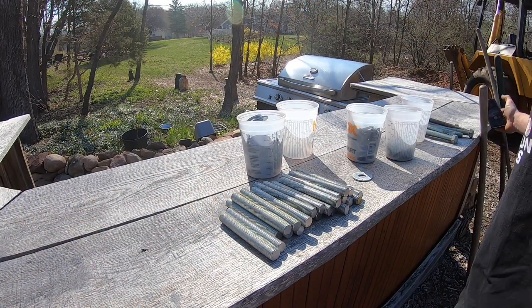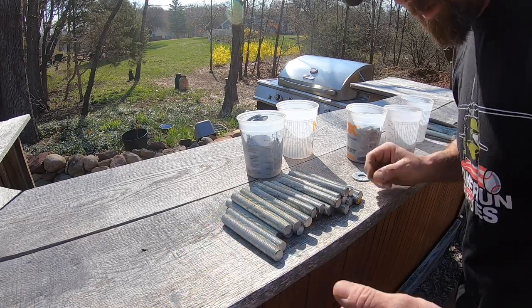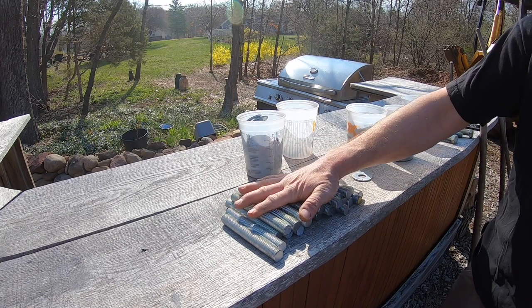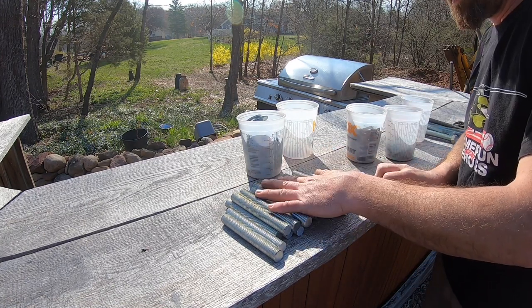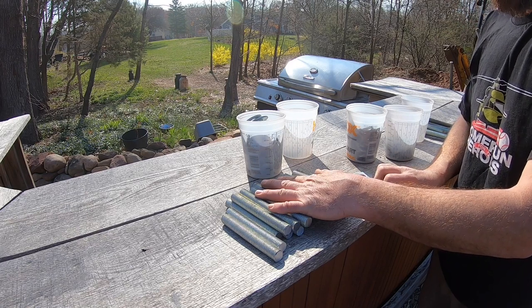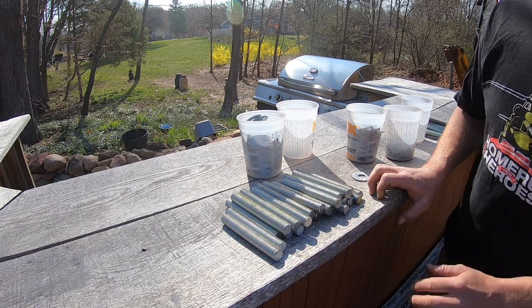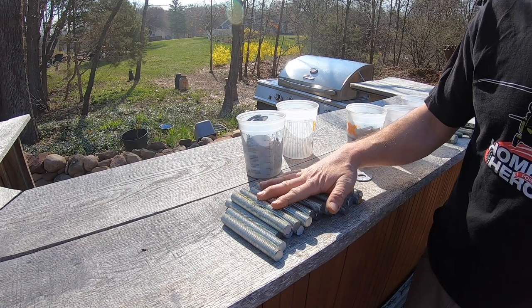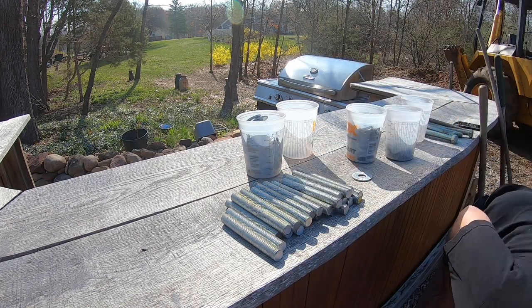There you have it. There's 24 rods, and I cut those in a matter of, I don't know, it maybe took me about 10 minutes to cut all the rod for the support system. So now I'm just gonna thread on the nuts and get them ready to go into the base, because we'll be fastening this to the steel I-beams, and then we'll be raising the track and then putting the track onto the top of this, and we'll be able to level the track up and down using multiple nuts.